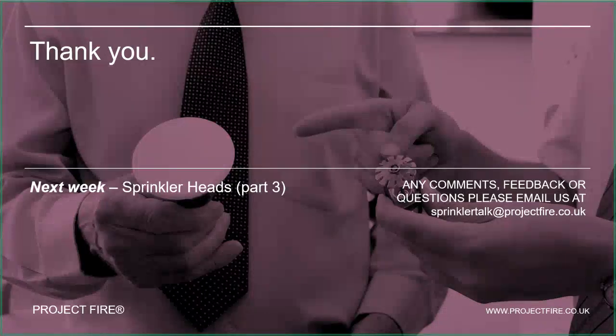We are aware of that through our BellCheck product. Our BellCheck product automatically tests the alarm valve, and when it's on a town main supply, we are relying on that non-return valve on the incoming supply to push against to make our product work. So on occasion, the BellCheck has not worked, and we've said, okay, have you checked your non-return valve on the town main supply? And when they've checked it, they've found that it's not working anymore. So in a way, we've done them a favour by pointing out that this component has failed, and then once that's replaced, our product will work. It's just pushing against it to keep it closed while we're doing our test.